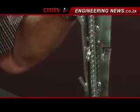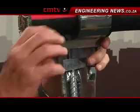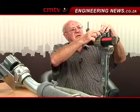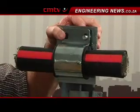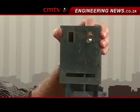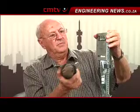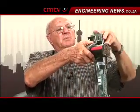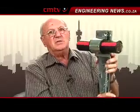This is a combination of the medium and heavy-duty unit. They are both identical in design and structure, with the exception that the cable bush is sized to suit the diameter of the cable. This cable in particular is a 185mm² cable. The ground anchor gets concreted into the ground. We provide an accelerator additive with our kit to ensure the contractor has the correct recipe for his concrete. Once the concrete is set, we place the bush around the cable, latch it into the cable saddle, hinge it up, and lock it into position. We then apply the shear nuts, completing the intermediate unit.